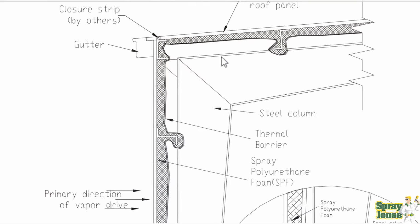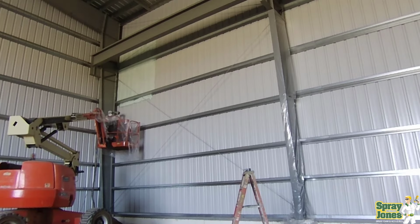You can't just leave these areas. You can't have this area here blank where there's no spray foam insulation, or a strip down the middle where the spray foam didn't get, or the spray foam, worst case, is very, very thin because you sprayed it on an angle, maybe only got an inch in there. You didn't cover the screws and the nuts and the bolts and what have you, and now they're going to drip. So you have to be very careful to get these details sufficiently thick, which begs the argument sometimes outside of the building is the correct way to go.